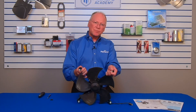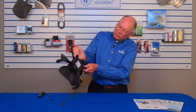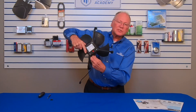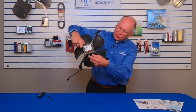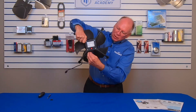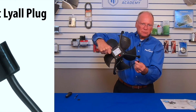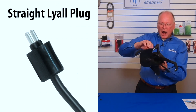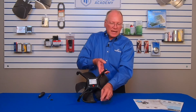These bolts are removable — you can take them out and put the bolt into a hole that gives you a different size, making the mounting very flexible. When installing this, keep in mind that the plug should be in the down position, at the six o'clock position, so that condensation cannot run into the motor. Whether from condensation or a washdown, this keeps moisture from going up into the motor. This motor can operate anywhere from 100 volts to 240 volts, and you don't have to make any connection changes — it will sense those different voltages and operate at the correct speed within the acceptable voltage range.